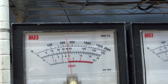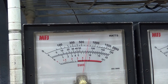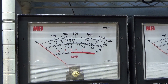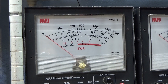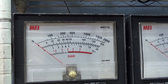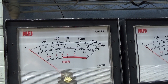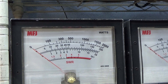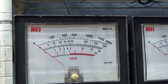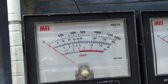What is happening is watt meters are basically calibrated voltmeters, and they're calibrated to 50 ohms. So on a dead key, if your match is perfectly 50 ohms — and 50 ohms only — a watt meter can be accurate, and only on dead key. They are calibrated for dead key and only 50 ohms.